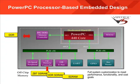Often customers will ask how fast the embedded system can run. Now that will depend on the processor and the number of peripherals on each bus. Specifically, how many LUTs and registers are required for each peripheral on each bus will determine how fast each bus will run. Since the PowerPC 440 is a fixed ASIC, its performance is guaranteed.